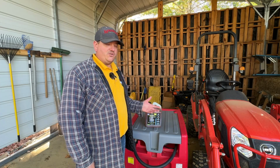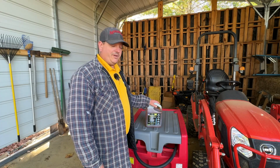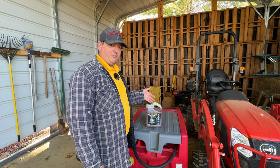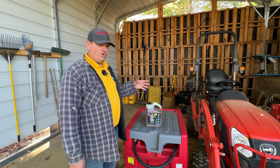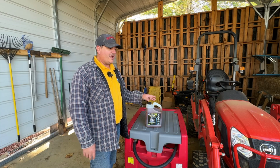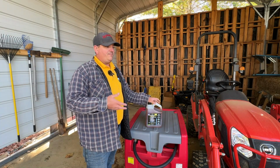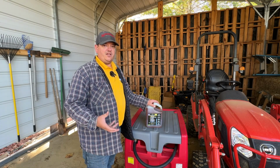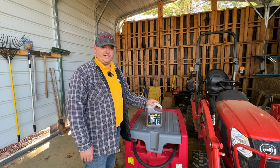So I know today's video is kind of turning into a long video about diesel treatment, and this is not an advertisement for them. I bought this myself, and this is what I believe is the best all-around diesel treatment. And it's kind of an all-in-one thing to where you don't have to have multiple things, which is why I called them. I told them that I needed to stabilize the fuel and needed to keep it from gelling, and it was going to be in a storage tank, and this is what they recommended to run through the wintertime.